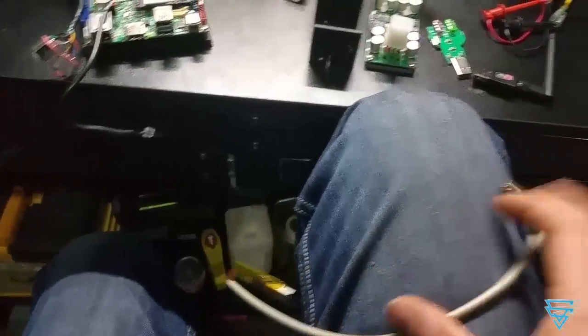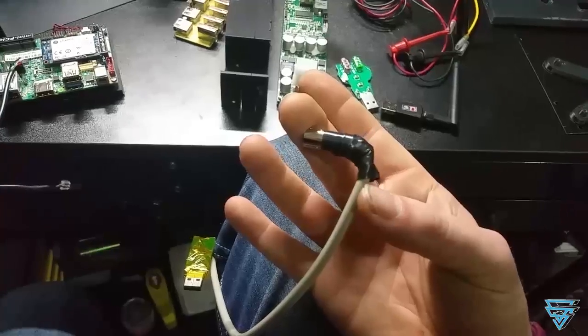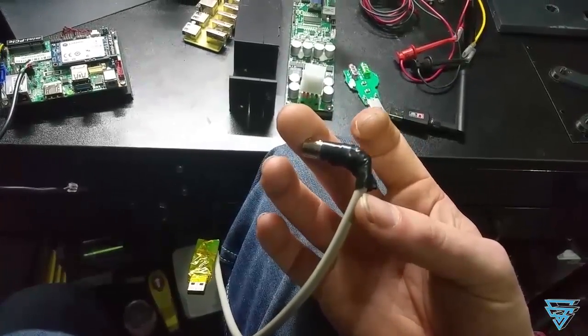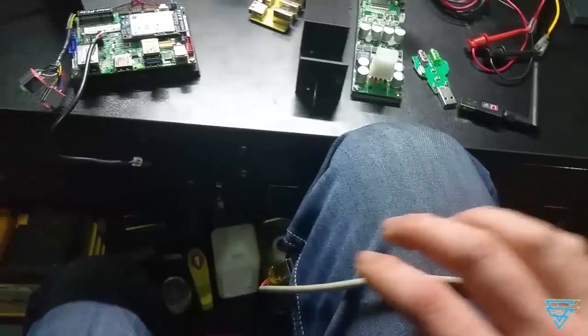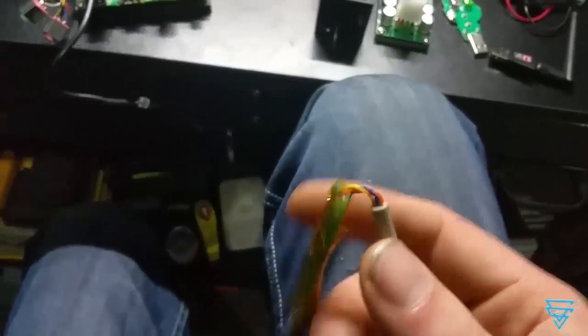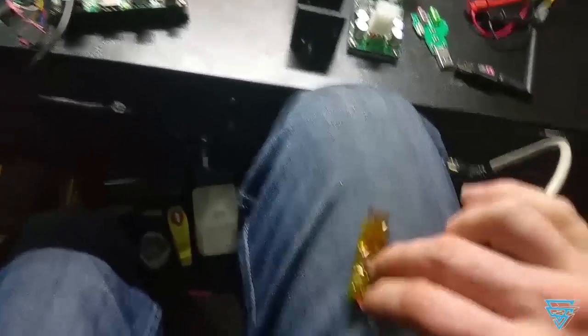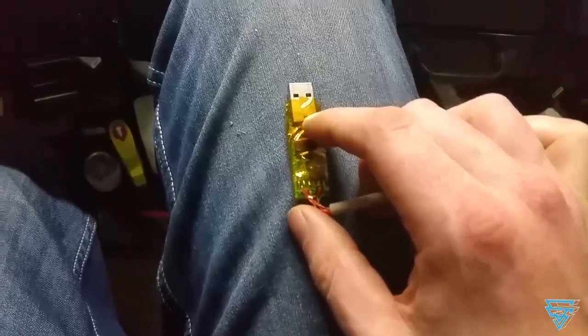But basically, I cut the casing off of it so I could get a harder 90-degree bend. The wires are still attached, and it's hot glued inside, and the black tape is just to make sure the stuff doesn't short out. I made it shorter by just cutting the leads off. I documented what colors went where, and then resoldered them back to the board.